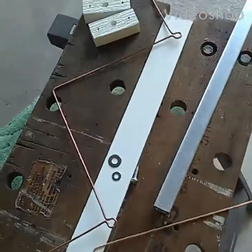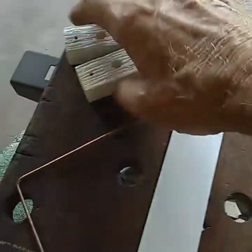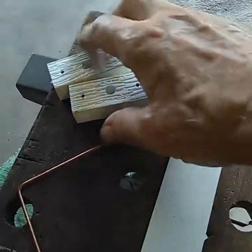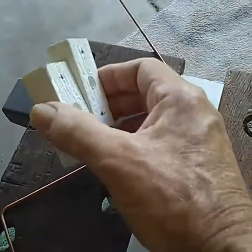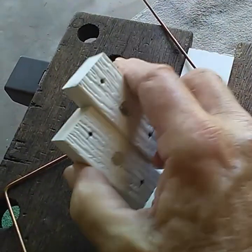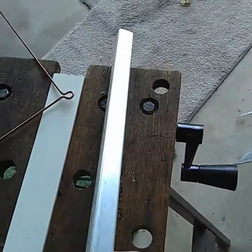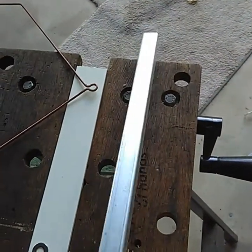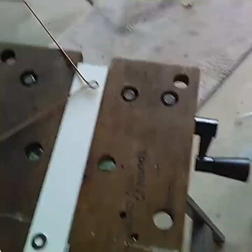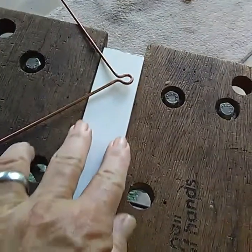Here's an alternative to mounting the Gray Hoverman element. I have my insulators I normally use — I cut these out of PVC lumber and they work out very well. I attach them to aluminum for strength, and it's the way my retail antennas are made.